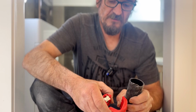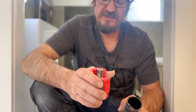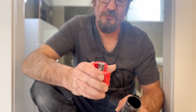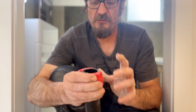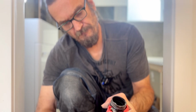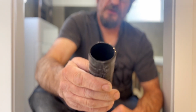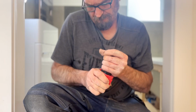One of the biggest problems that people are encountering is a corkscrew cut. The biggest reason for this is not having a sharp blade and not putting uniform pressure on top of the blade. Let me see if I can show you. And do remember that this does a directional cut, and you'll know by the arrows there. So there you go. Regardless if you're cutting it with the blade on the side or the blade in the center, the KNIPEX works just as good.